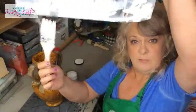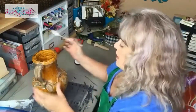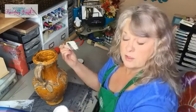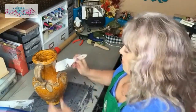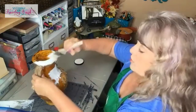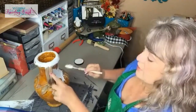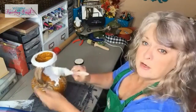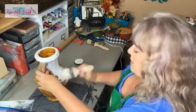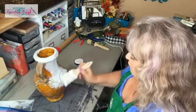I'm getting my chip brush out of the Ziploc bag where I had it in my refrigerator from the day before yesterday while I was working on the end table. I'm going to put it back in there when I'm done because I'm going to use more Slick Stick on the dresser and headboard that go with the same set. I wanted to slap a good coat on here this morning before I go to work so that when I get home tonight, I can do the fun part. I'm just slapping it on — it doesn't have to be anything neat. I want the paint to stick and stay.